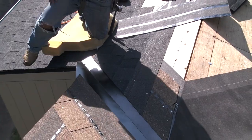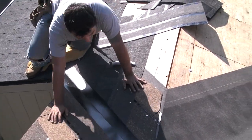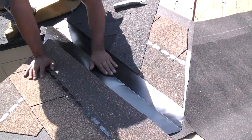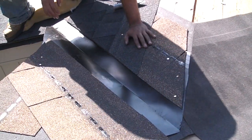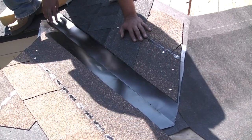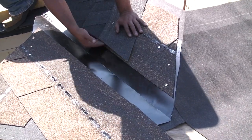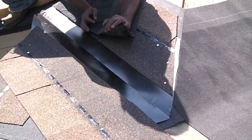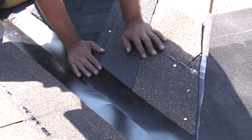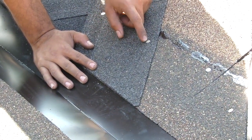Now you've got your straight edge. The problem is when you leave this tip on. When there's a rush of water here, the water is trying to find the straightest way down. So obviously it'll go down here, bump off of this starter, and even try to crawl underneath. When it does, it's going to try to grab onto anything — in this case it'll grab onto this. The water will run along here and catch this nail.